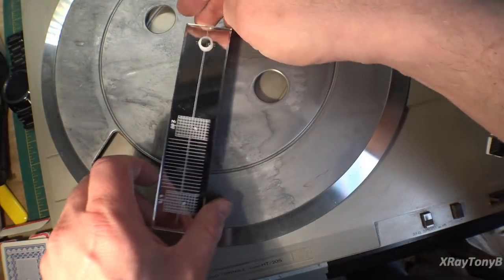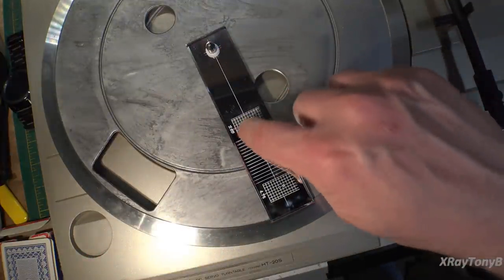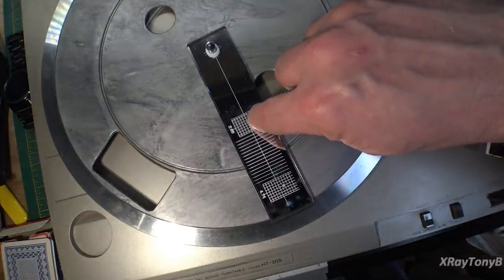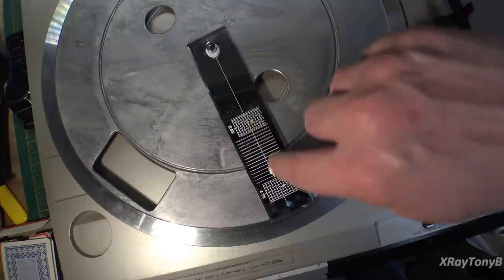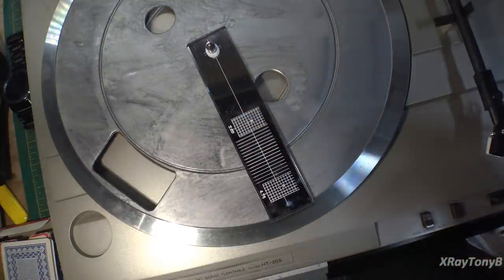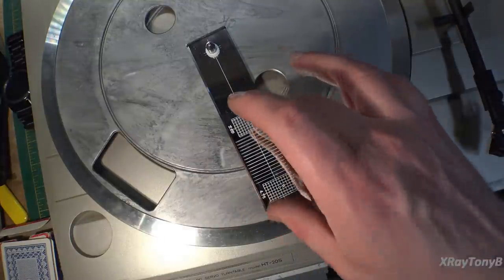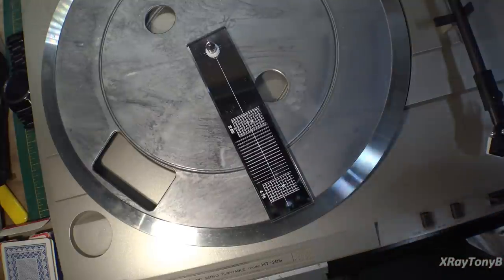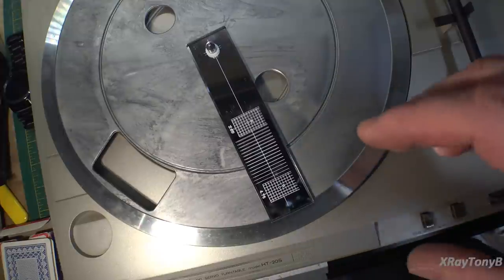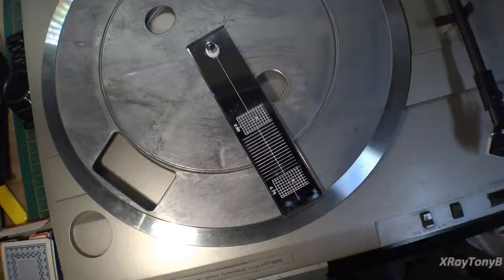You can also use a commercial protractor like this, which is a mirror, and it has a little grid network, and it makes it a lot easier because you can actually put the stylus tip right in these little circles here, A and B, and you can go back and forth and adjust them. It's the same thing as when you use the line, really. There's no difference, but this just makes it a little easier to visualize. If you just use the paper with the line on it, you're going to have to stoop down and look at it very carefully. But that's pretty much it.